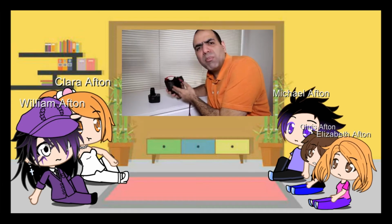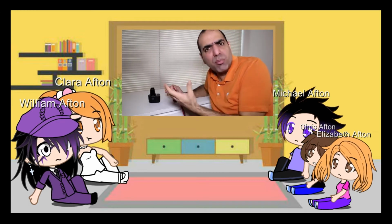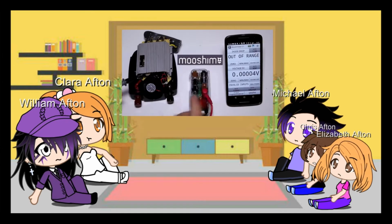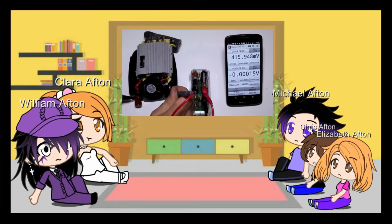Not only is it completely broken, its 50 amp fuse is blown. Who designed this? Reverse polarity protection relying on a 50 amp fuse to blow? Seriously? It's like cutting your dick to prevent pregnancy. I replaced the fuse and now if I connect my mushy multimeter to the input terminals of the inverter in reverse, I can clearly see that there is a diode drop voltage across the terminals.